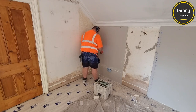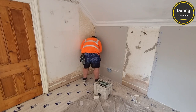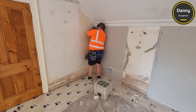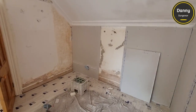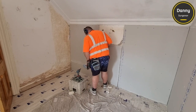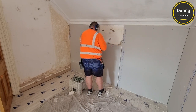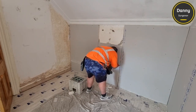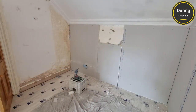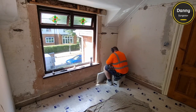This is one of the more common things to happen to people who aren't experienced putting insulated plasterboard on - they actually go through cables. If you're lucky, you go through the cable and it knocks the electric off there and then, and you know something's happened. Take the last board off, see that you've damaged the cable, dig it out, get a spark to come and fix it. If you're unlucky, it doesn't trip - the fuse box is old or whatever - and it just sits fizzling for a few weeks. You've plastered and the skimming's good, and then all of a sudden the electric starts tripping because the wires are burnt out, and you're back ripping walls open.